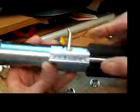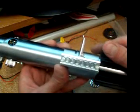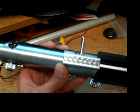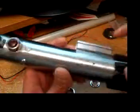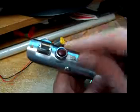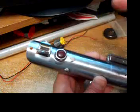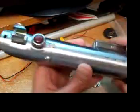Now what you can do — this will actually unscrew. If you don't like the bubble strip right here, you can actually buy — I believe Grayflex Shop sells these also — you can replace this with a little circuit board. There are two different types: one from Episode 3 and one from Episode 5, they have the circuit board like that. Grayflex Shop will also sell, instead of having to rotate this on and off, a little push button switch that solders directly to your board. It's real simple — positive, negative — you just press the button, click it up, click it down instead of having to rotate it back and forth.